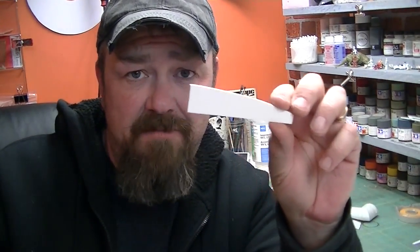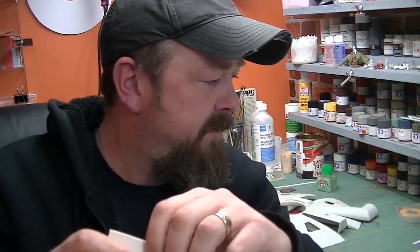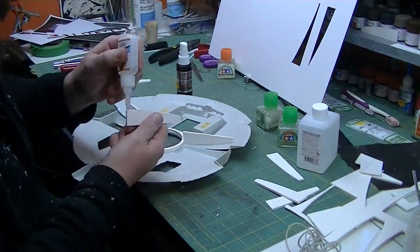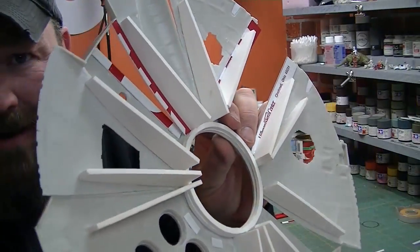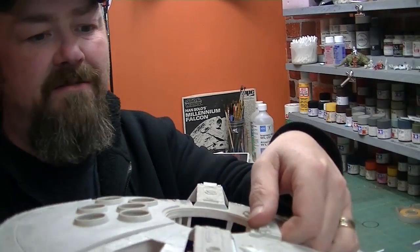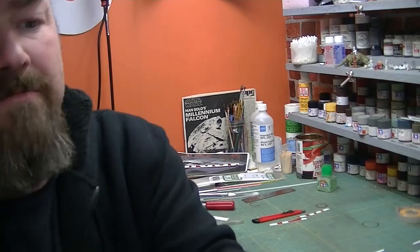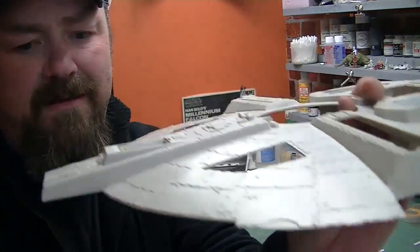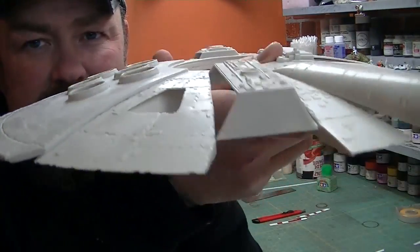I got a pattern made based on Joshua Maruska's plans — I'll put a link to those underneath. I scaled it to the MVC Falcon and pulled that line out in CorelDRAW as a vector file, so if you use Illustrator you can get that shape. I made a master, cut eight or ten ribs, and glued them all inside. It ain't pretty but it's working. Everywhere the hull needed a little pull, it's now quite a bit more curvy.